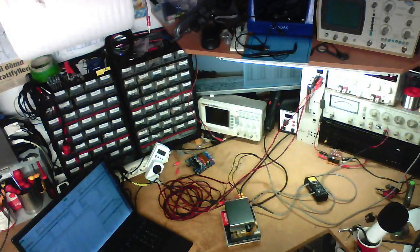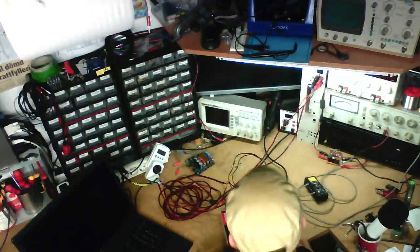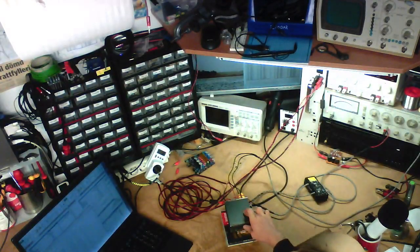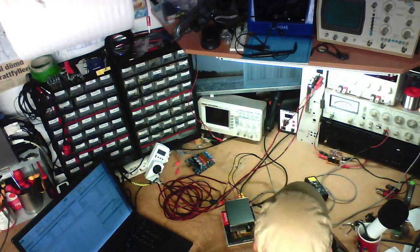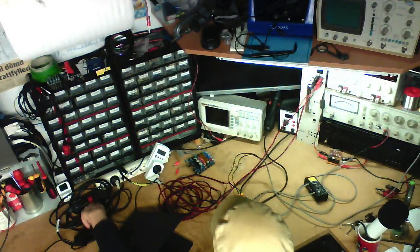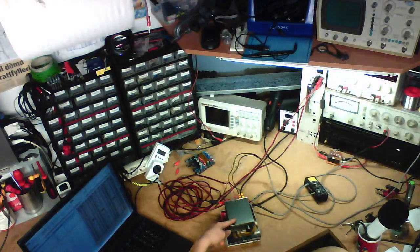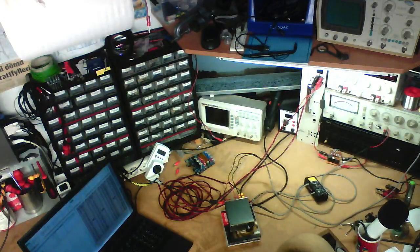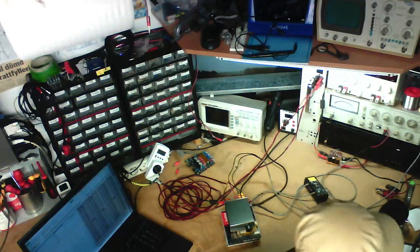There we go. Yeah, so I've just got the TPA3116 connected up to the meter. It's currently putting out about 5 watts per channel, and behind here I've got a laptop power supply actually powering it, because, yeah, I think I made a video on it. It's a $20 amplifier which runs fine off of a laptop power supply. So I want to figure out just how much power you can actually get by just using it with your bog standard laptop power supply.